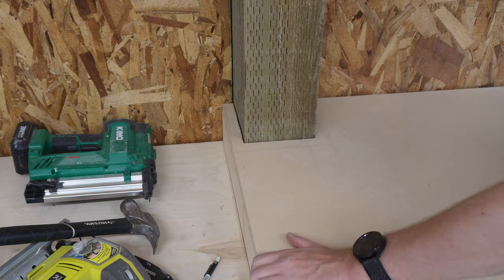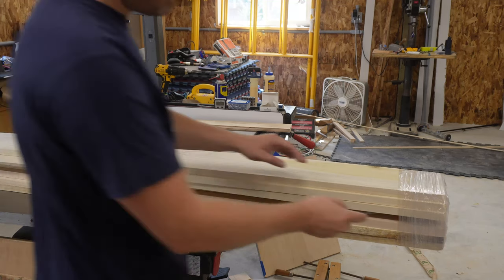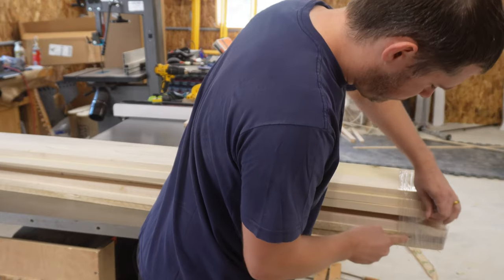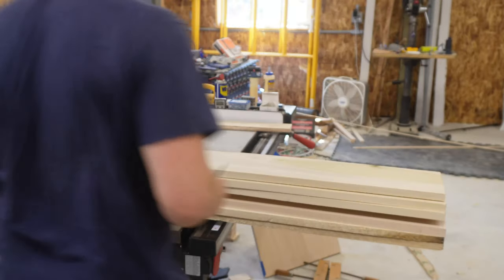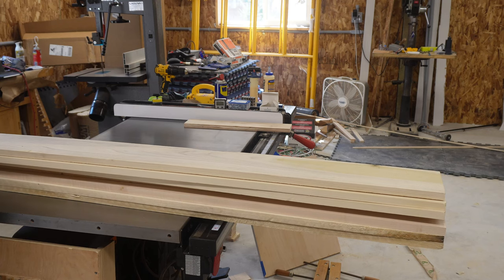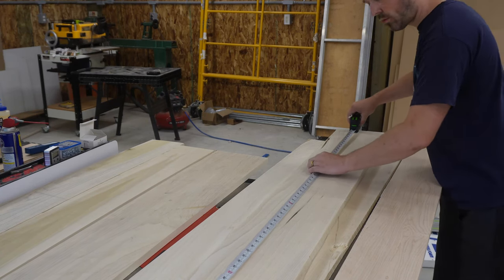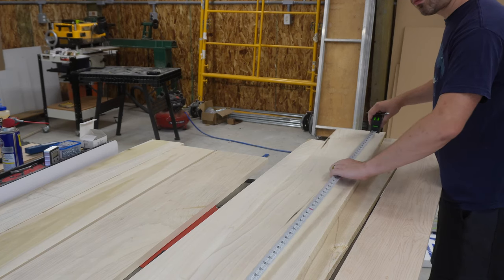The next logical step was to start working on the tops. Here I'm using MDF as my topper. MDF on its own is something I usually avoid in the shop, but here it's going to be great because I'm going to be covering it in laminate, and MDF is nice and flat and heavy out of the box. The only hiccup was marking around a post, so I just butted the piece up against it, marked out where I needed to cut, used a jigsaw to cut the requisite hole, and shimmed the whole top in place. I ordered some hardwood online from Woodworkers Source — some poplar for shop furniture and a little bit of maple to spice things up around the countertops.